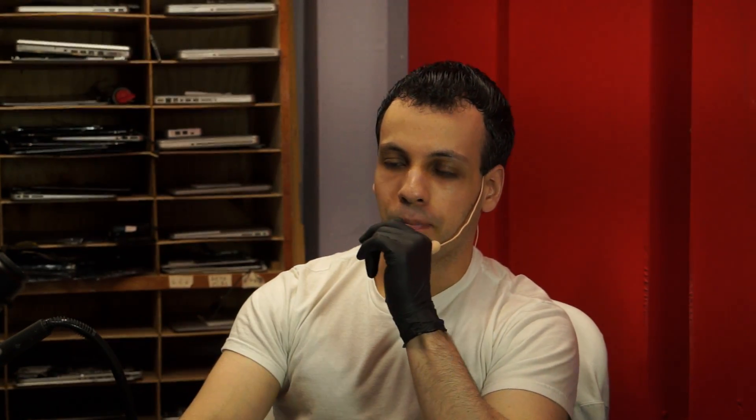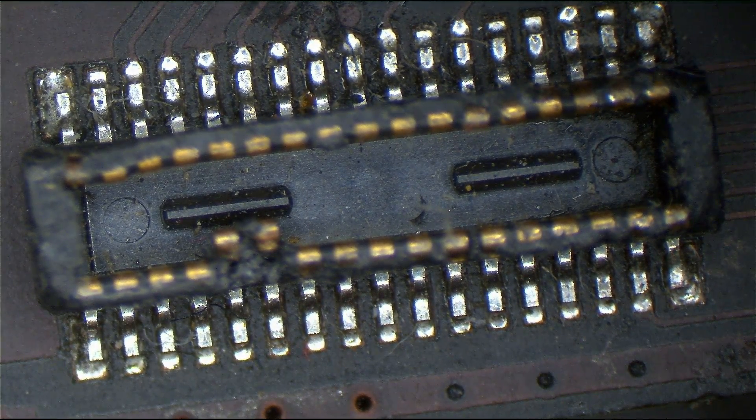Let's say the PP3V42 pin on that is totally burned but everything else looks nice. I would then be able to deduce that the PP3V42 rail had ripple on it and look at everything along that line to start troubleshooting. If I saw an issue with some data line that's not easily apparent when I look at the board, I could ask what that talks to, look at the chip it talks to, remove that chip, and find a completely burned solder ball underneath. I would have never seen that with my microscope or upon physical inspection alone.